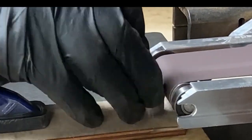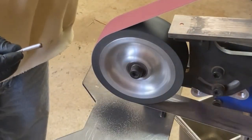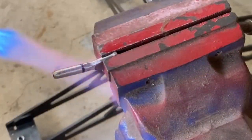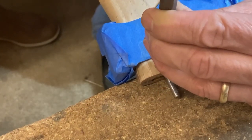I plan to create a tapped finial and a special steel wedge that will have a threaded protrusion for the finial to screw onto. I designed the finial in the shape of a crown with a recess in the top, in which I will set a hessonite garnet. The completed finial. Now I will create the threaded steel wedge that will allow the finial to secure the eye cap to the handle. I am using a portion of a worn out spade bit to create this wedge. Once the wedge has been inserted into the top of the axe handle, I also add a hardened steel pin that runs through the handle and the steel wedge to further secure the mechanism.